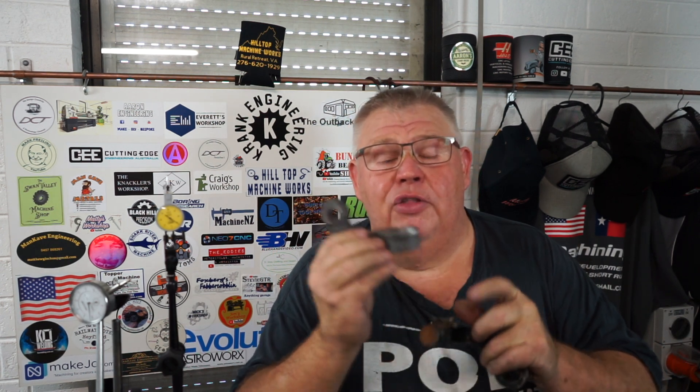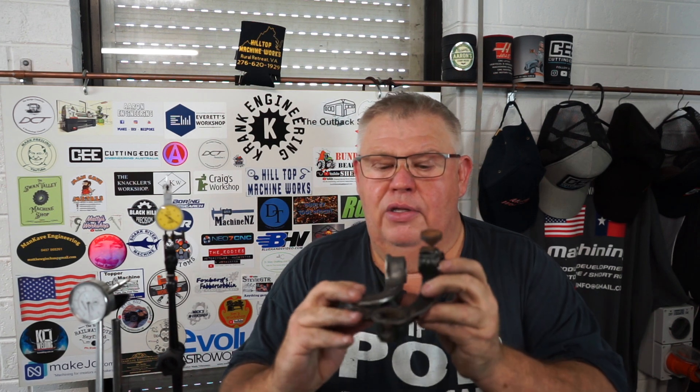What could I have done to speed this up? Well instead of boring the holes, I could have drilled and reamed them if I had the right size reamer, which I don't. Good quality reamers will set you back a hundred, a couple of hundred dollars. The cheap ones I've been buying off AliExpress - you get what you pay for. They're called chucking reamers, but when you so-called chuck them, they don't run that true. Anyway, look, there it is. I'm not going to do this part today - I'll cover it on my CNC channel. I'd do that in CAD, then CAM, then CNC machine it - shouldn't take that long. I'm really happy with it. I reckon I'm well and truly 90-95% on spec with the old part.